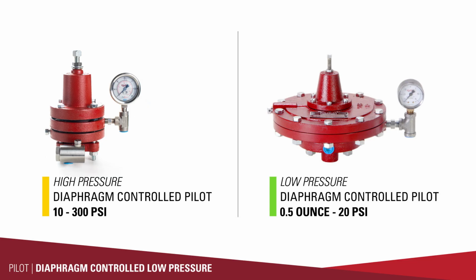If you do have applications that are right around that 10 psi, there's some overlap between the pilots. Be aware of that. If you are around 10 psi and you're never going to be above that, it's probably a good idea to use the low pressure pilots instead of the diaphragm controlled pilots, just because you'll have a wider operating range. You can dial it in a lot better than if you're operating at the minimum of the diaphragm controlled pilot.